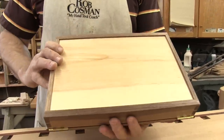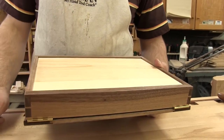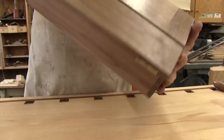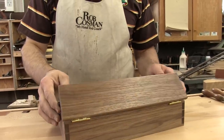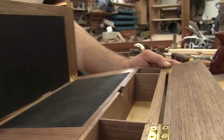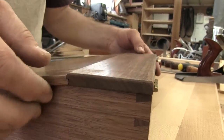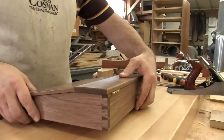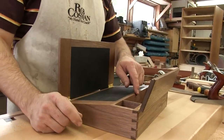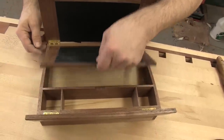We've got a groove cut in the bottom. I used solid pine on this, and in hindsight I probably would have gone with walnut just to keep it consistent — but this doesn't get seen that much. That panel is made to fit in a groove. Of course there's mortising hinges, because these have to sit in there nice and flush — four hinges to mortise. We've got a rabbet cut on this lid and on this one, so that when this one closes it prevents that one from flopping open. There are dados cut with a small cross-cut saw to house these dividers. I used a rasp to cut this little finger recess, and a carving gouge to cut that little recess so you can pull it up.